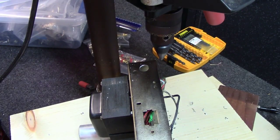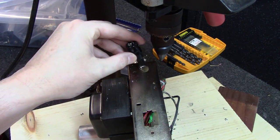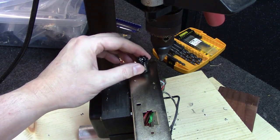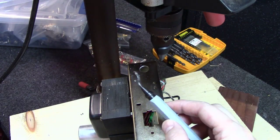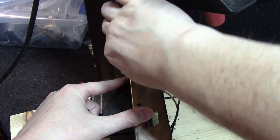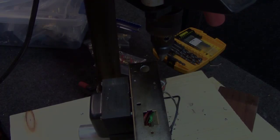And as you can see here, I used this little stepper bit, went down into the chassis to the point that this thing drops right down in there, and I've got a nice fuse hole. Sometimes you want to use a little metal reamer like this that you work around the hole, and it reams out any rough edges.